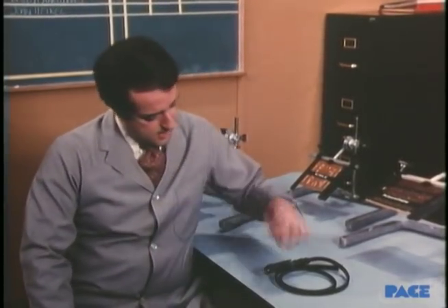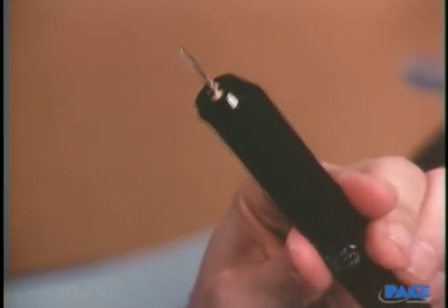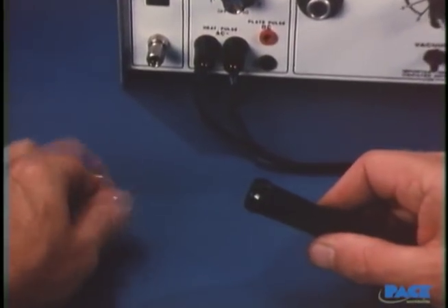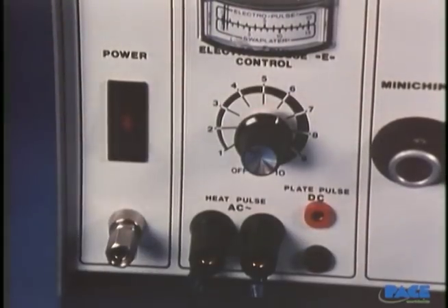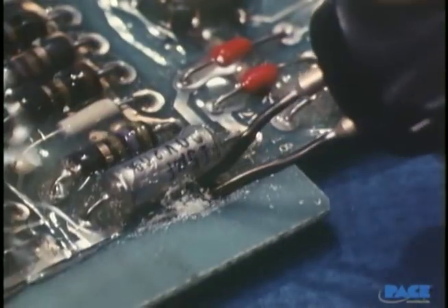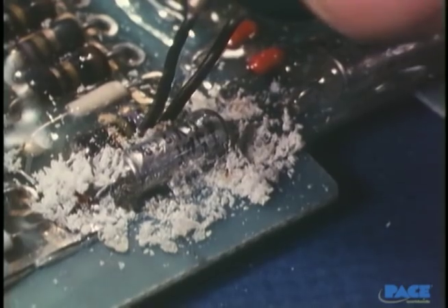The use of controlled low-temperature heat is the basis for the thermal parting method — it's the best way to handle the problem of thick coatings. A special tool called a thermal parting tool has been designed for the job. It's temperature controlled and comes with tips of various shapes; they have no sharp edges. The low temperature used allows you to over-cure the coating and break it down without burning or charring it or producing toxic fumes. The appropriate tip is selected and inserted, and the temperature set just high enough to break down the coating but not so high as to burn it. The thickness of the coating around the component body is gradually reduced, taking care not to contact the surface of the board.